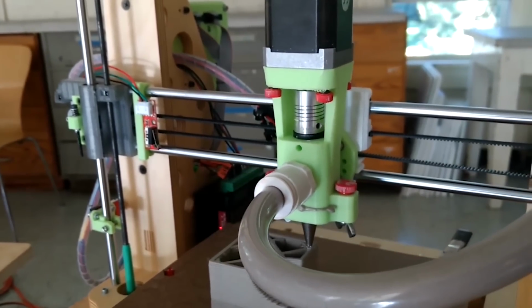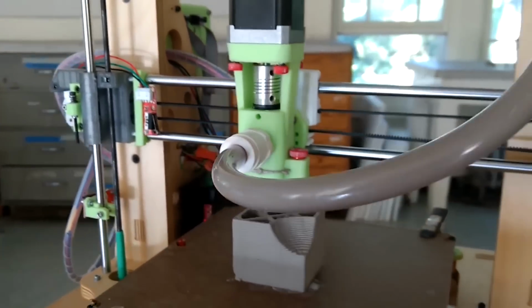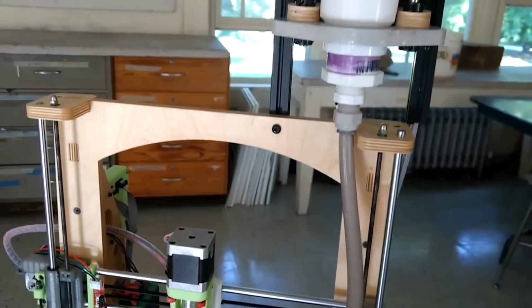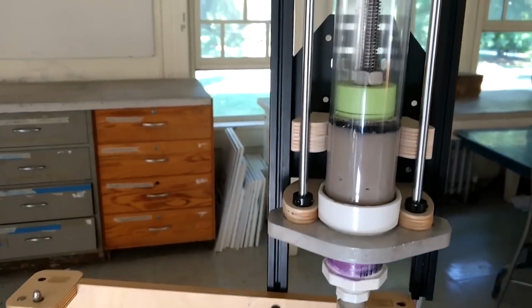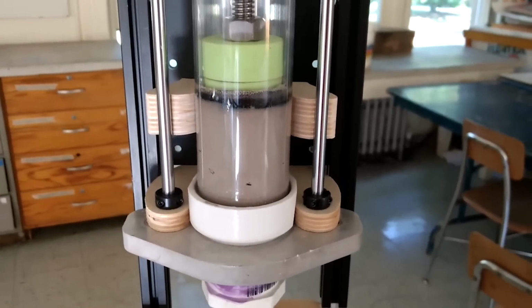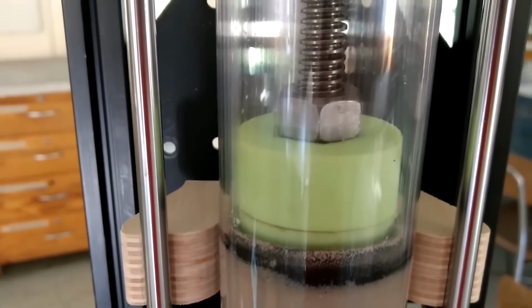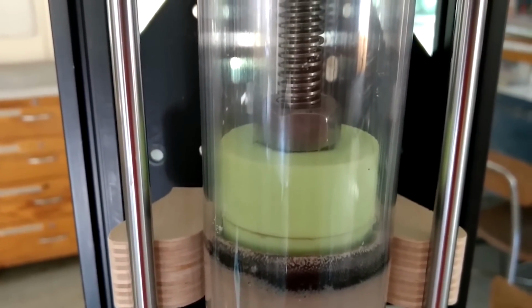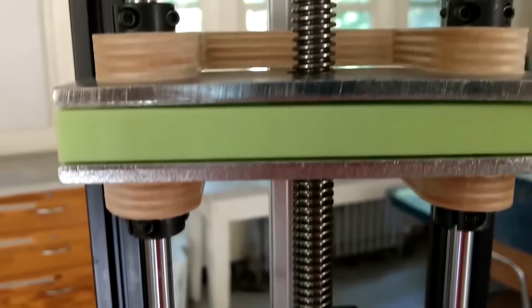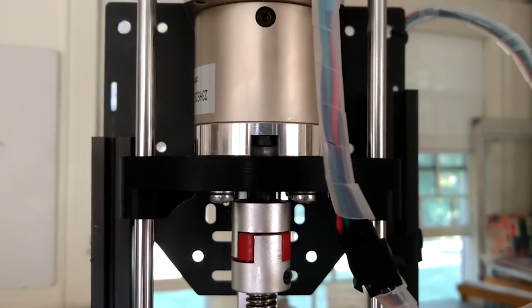had a very large sort of mechanical syringe. And so it became very important that both the auger and the mechanical syringe would move in unison, so that if the big mechanical syringe didn't pause when the auger paused, it would overwhelm the auger with clay. And if the auger was spinning to try and release clay, but the big mechanical syringe was not, it would sort of run out of material to dispense onto the print platform.